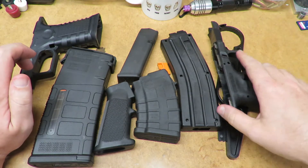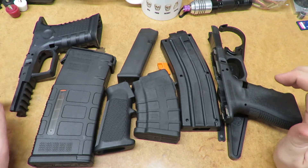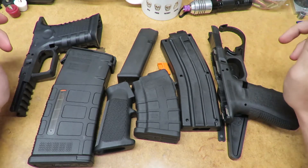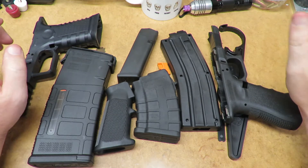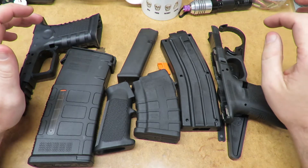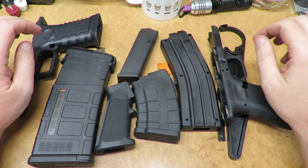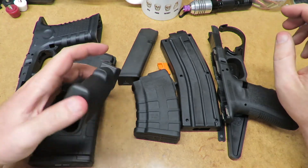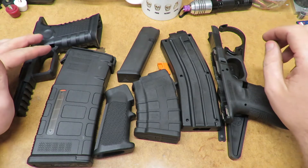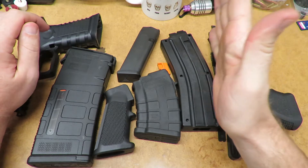The Glock frame and this little Hogue wrench here are made from a pure polymer. The machine used to make these parts is an injection molding machine — it's a big machine. Some I've worked with are 15 feet long end to end, but the ones used to make smaller parts like a grip or a magazine are smaller, probably 10 to 15 ton pressing force.